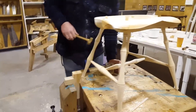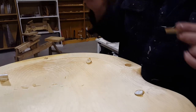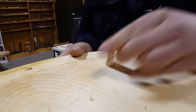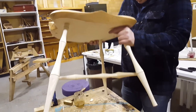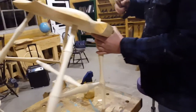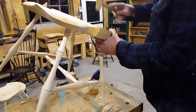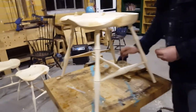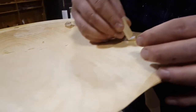I'm not sure if you can hear that on the camera but that's pretty critical to me. Smear a little glue on this. I always get my wedge started before I pound the leg in, because if you get that too tight then you can't get the wedge in — sometimes it's a pain in the butt. So I get the wedge started first. I put the leg right over it. I don't want any rebound whatsoever, so I got to put it so the force is transferred directly to the floor. That's tight. One more. Oh, this one is low profile.